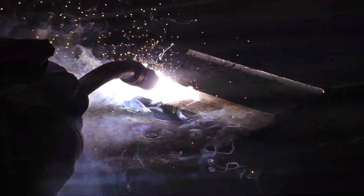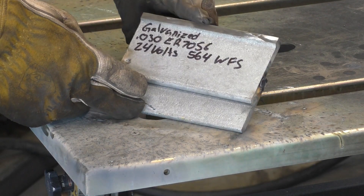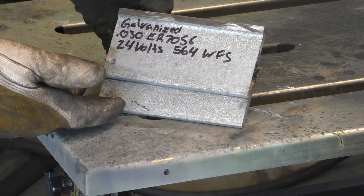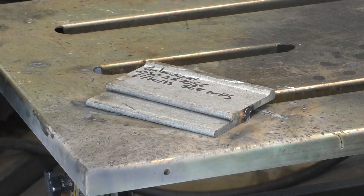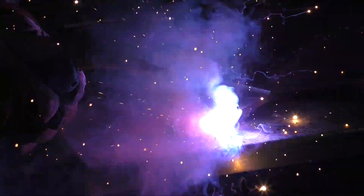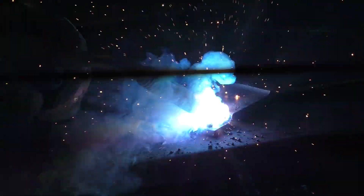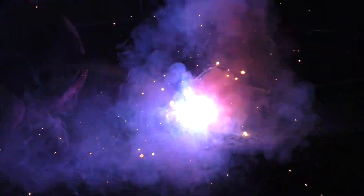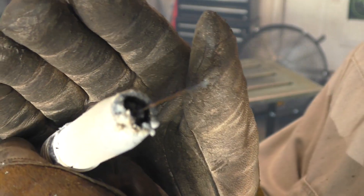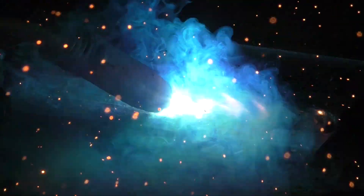The next three processes I have zero experience with on galvanized material, so let's get to it. We're going to MIG weld this one using .030 ER70S-6 wire and 75/25 shielding gas. I'll set the machine to 24 volts and 564 wire feed speed. It was a complete disaster - I couldn't finish the coupon due to so much spatter buildup in the nozzle. Having only welded about an inch, it still managed to damage the nozzle and diffuser. After removing the nozzle buildup, I tried again but this time I ground down the weld zone to shiny metal, which still didn't help because it drew in the galvanized between the two plates. Here are the results.